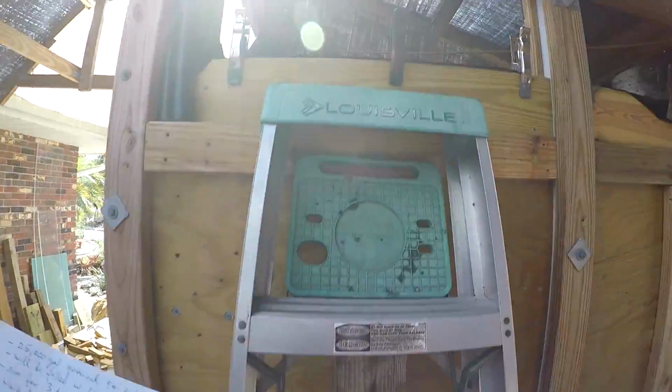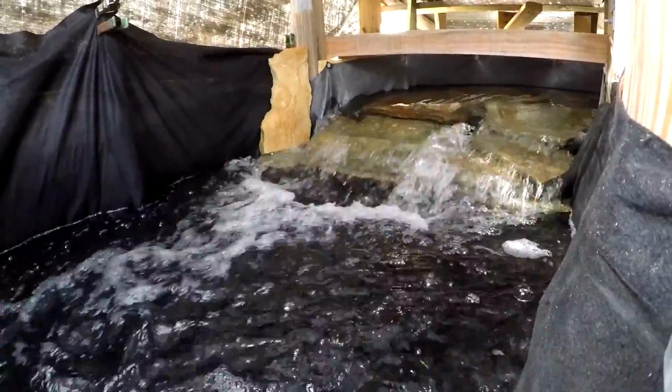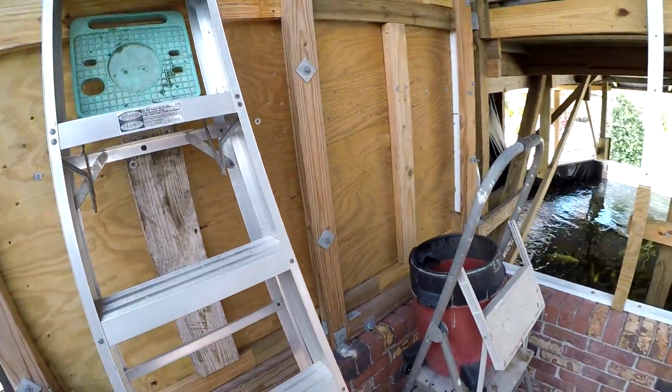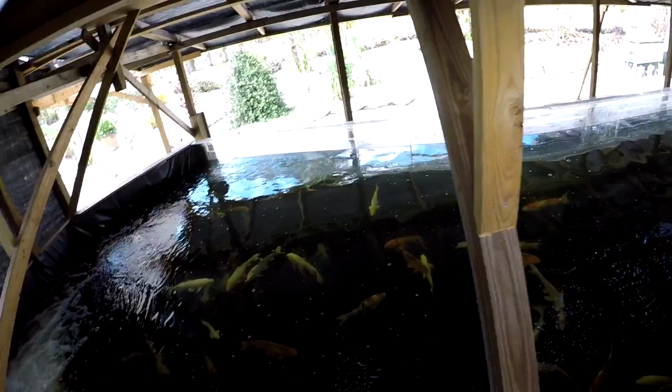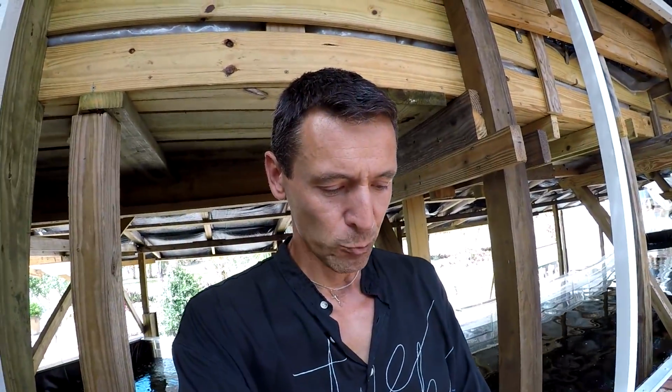And the lining of the filter: for the underlayment I used greenhouse plastic sheeting, and for the liner itself I used 20 mil PVC liner, 14 feet by 21 foot. The stuffing only has 1 shelf, and I placed some cut up 4-inch corrugated piping on the bottom, and then I used about 7,000 nylon mesh pond scrubbers as a stuffing for the shower tower. And the water free fall is about 30 inches or so.